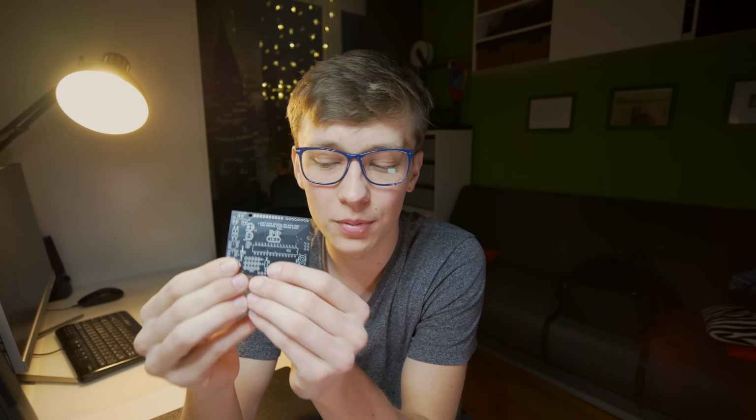original Arduino. Also, this is very simple to build for anyone, even total beginners with soldering, because I used mostly THT components. THT means through-hole components. Those are super easy to solder. There are just 2 SMD components, and those are the 5 volts and 3.3 volts voltage regulators.